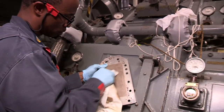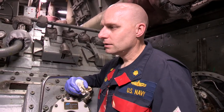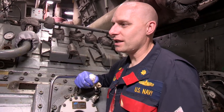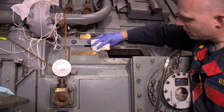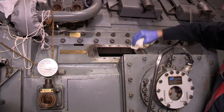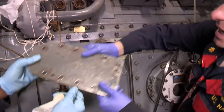Get people down here who haven't seen it so they have a better understanding, but the actual maintenance should be your detail-oriented, clean, conscientious sailors from MP division doing the work - with more supervision than they probably care to have. When wiping on these surfaces, you always want to wipe any debris away from the opening and far enough away that it's not going to come back on your rag. You never want to brush anything into that access.